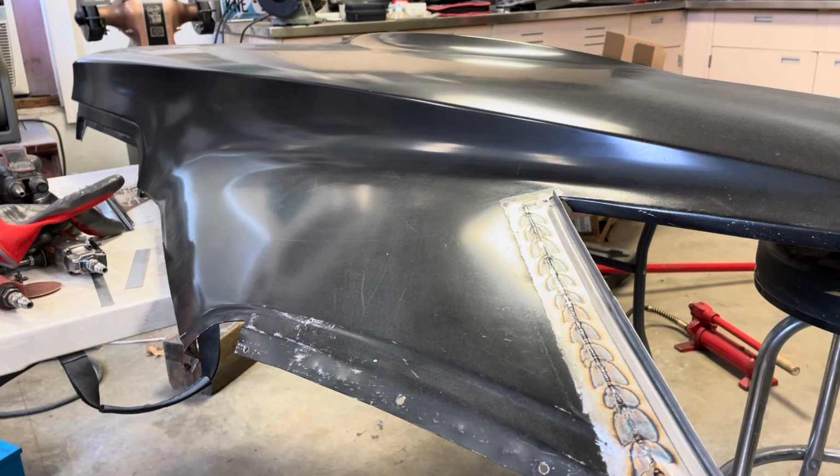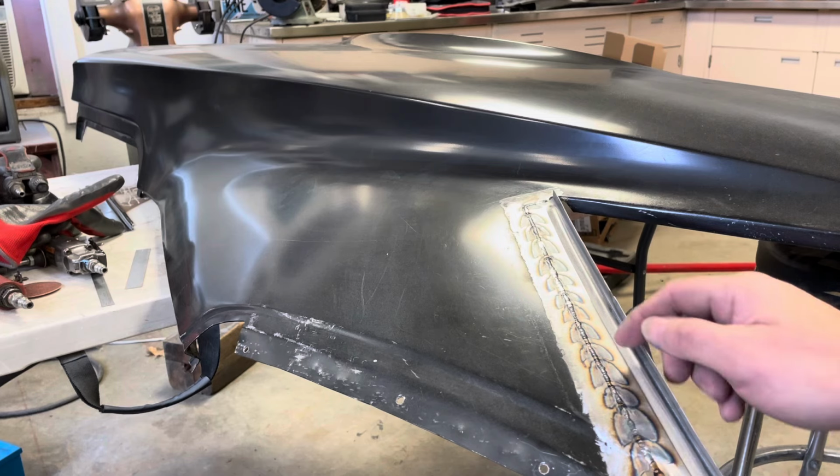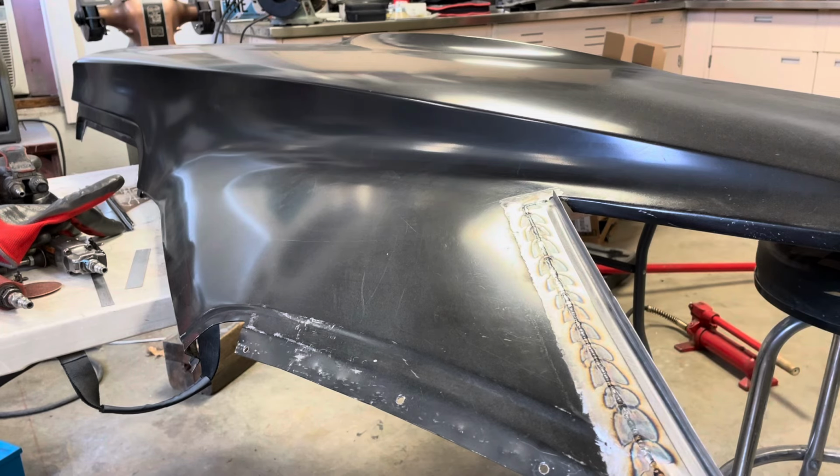And I may look back at this video eventually and go, wow, that is some sucky work. But right now, I don't see any good examples of welding just an 18 gauge or probably 20 gauge sheet metal that looks much different than this, with no heat zone. I know that these are probably a little bit taller than they should be. Got good penetration. I just need to keep working on this until I figure it out, but I need an example, I guess, is what I'm saying.